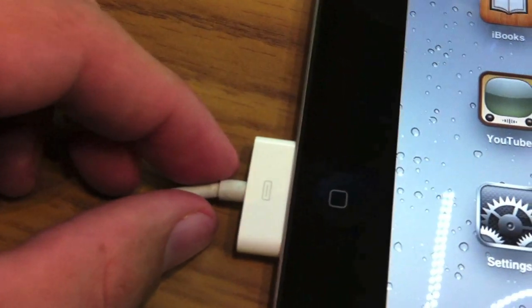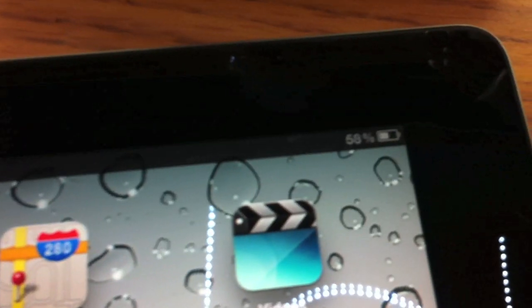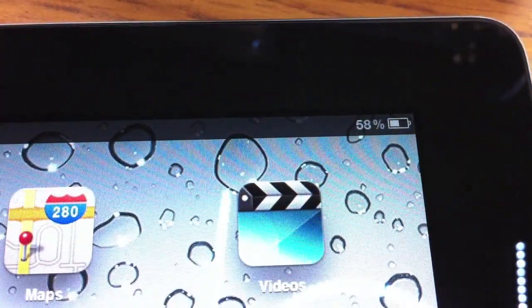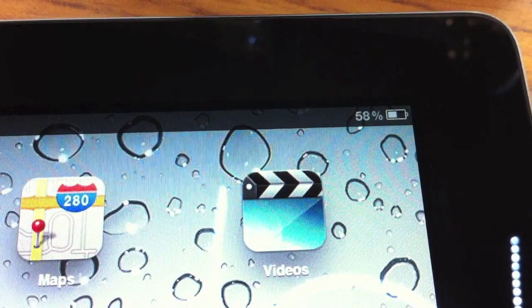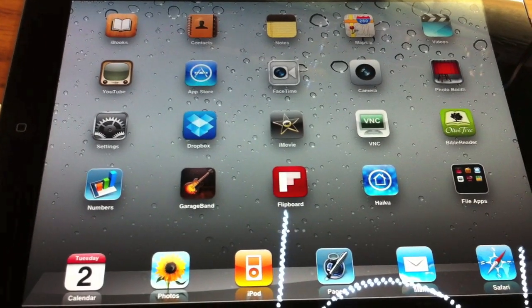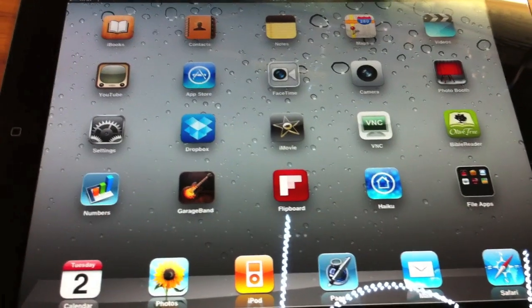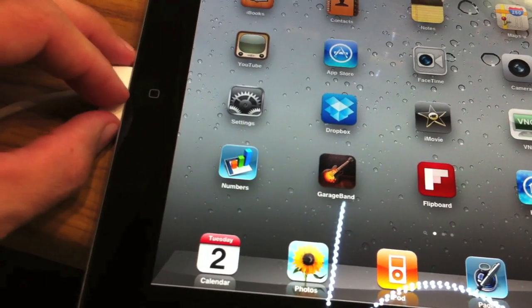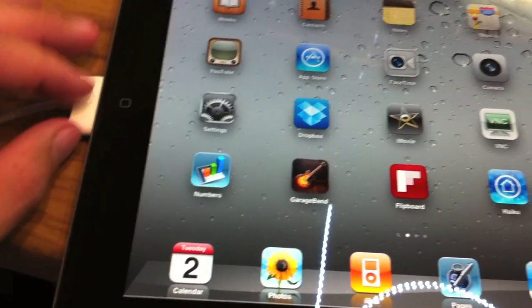It's plugged in tight, and you did not hear the noise because it does absolutely nothing at all. So if you don't have the right voltages on the data plus and minus of the USB, it does not even recognize that anything is there. That's why it's very important to get those values correct, because the iPad itself dictates how many amps, including 0, it pulls to charge the battery.